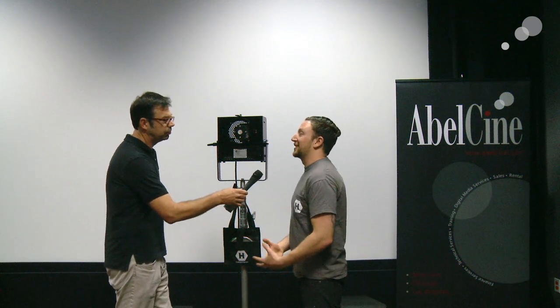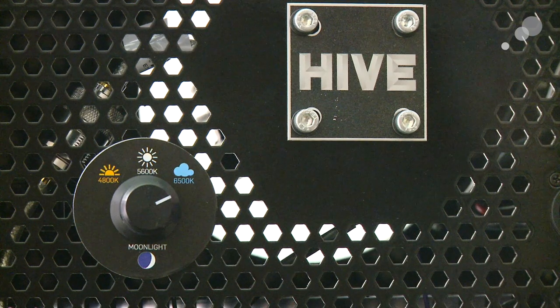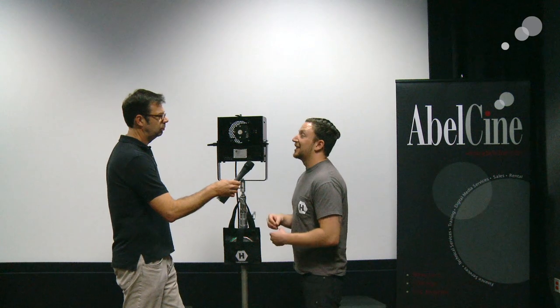Let's talk about color temperature. One of the cool things I used to do with the Wasp was put it in low mode and see the color temperature drop to a really interesting blue. But I've noticed you now have a dial on the back to control color temperature. Absolutely — we've added what we call our Daylight Dial, which lets you control color temperature throughout the usable daylight range: warm it up to almost a sunrise/sunset 4,600 Kelvin, bring it to your standard 5,600 Kelvin, or cool it all the way down to about 6,500 to 7,000 Kelvin. On a location shoot when clouds roll in, you can just turn the dial and in about 10 seconds it will reach the new color temperature — no need to gel all your lights.